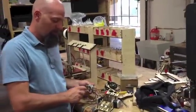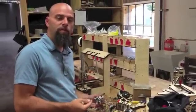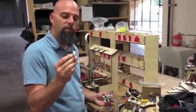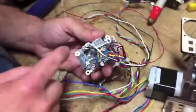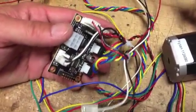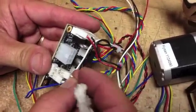The extruder board firmware is set up to have three extruders. As a safety measure, if you hook up an extruder, it's requiring that you have a thermistor. This is actually just a thermistor that we use. Normally, if you had three extruders, A and B would have a thermistor plugged in. But if you're only running a dual extruder, you have to get a thermistor to plug in here so that the fail warning won't say it can't measure the temperature.